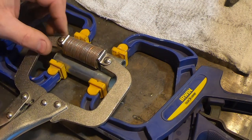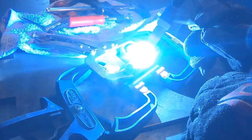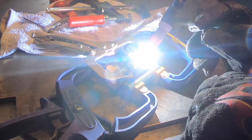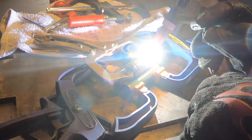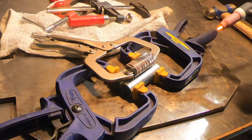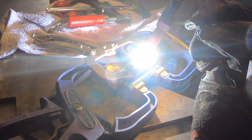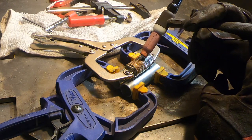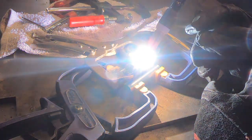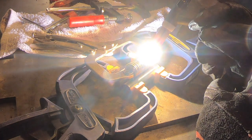The next task was welding these up. I've seen people tie wire around them to keep them together while welding, but I've got a TIG welder so I'm gonna TIG weld them. I had no idea how to TIG weld this kind of material, so I started at about 75 amps — that didn't work. Then I went up to about 100 amps — that also didn't work and I was getting a little nervous. But when I put it up to about 132 amps, that worked perfectly. So here I am welding at about 132 amps. I let it heat up a little bit and then put a line all the way down the quarters and that worked really well.